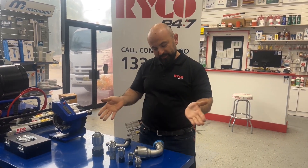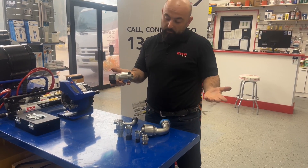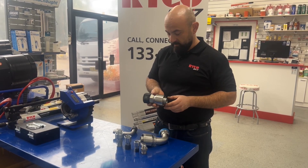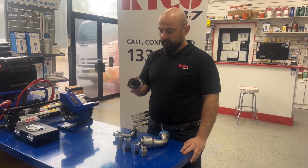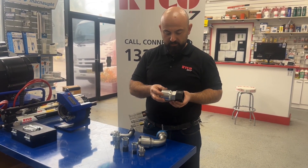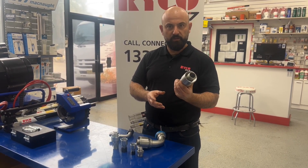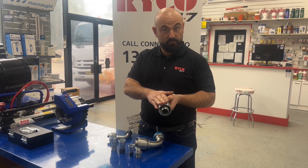So let's see my lovely array here of hydraulic hose fittings. This is what we would call hydraulic hose fittings, also called crimp tails or hose ends. Our design of the most common hose ends and hose fittings is a one-piece design, which means the hose tail and the ferrule is all one piece, ready to crimp onto the correct series of hose that this hose end is designed for.